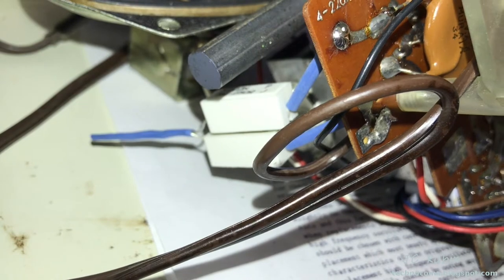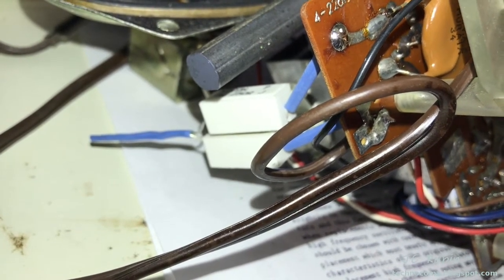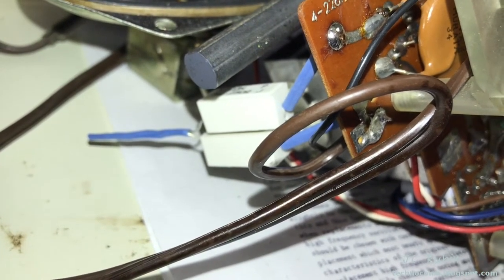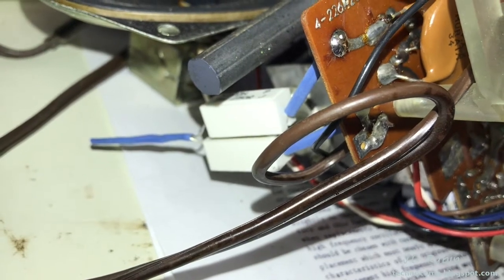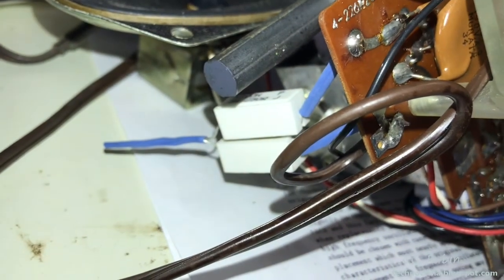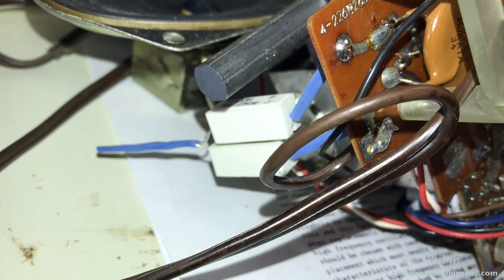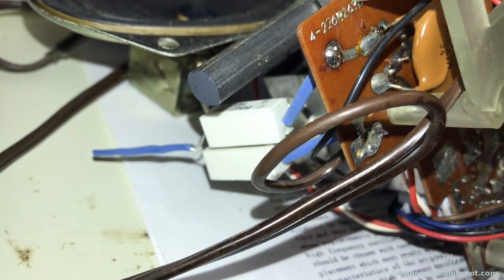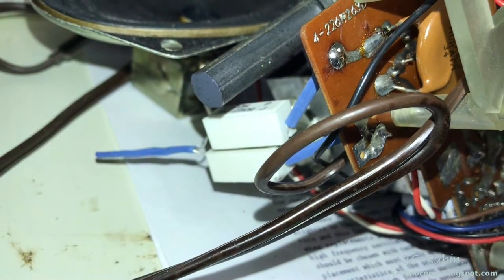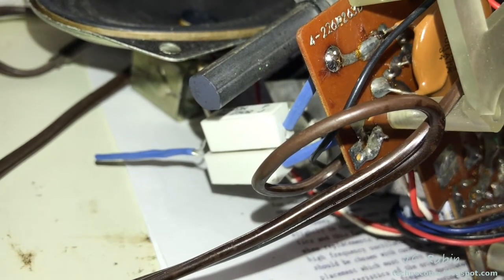What is going to happen is, even though there's a greater amount of resistance in this circuit, there are also higher line voltages. So we'll see if this fitting will work. I've left it in such a way that it can be removed and the resistors need not be wasted. That's why I have the tail sitting at the end of the circuit, so that I could pull it out if need be. And if it's not going to work, I could just order up a 470 at 5 watts or perhaps 8 watts and be done with it. When I get some voltage through here and start measuring some temperatures, then I'll see what has to be done.